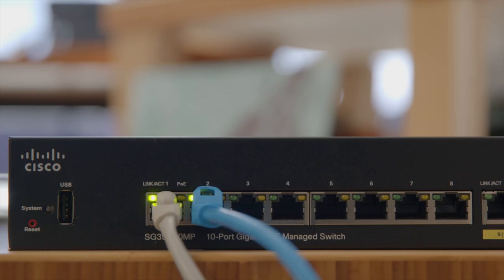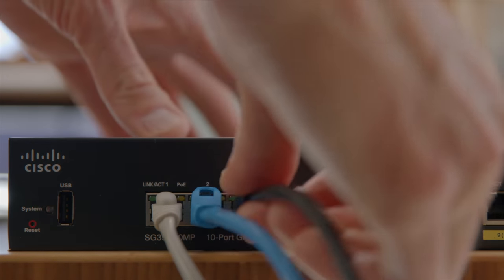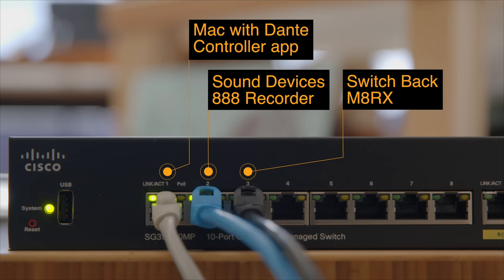What's super important about digital audio is that if you have multiple devices, they absolutely have to be in lock sync. What Dante does over a network is check for all the Dante devices on the network, specifies one of them as the master clock, and then that master clock keeps all the other devices in sync with less than one millisecond of latency, which is pretty amazing. One of the real advantages with Dante is that you just use standard gigabit ethernet technology — for example, I have a Cisco switch and I'm using regular Cat6 cabling, so you don't have to spend a ton of money on proprietary switches and cables.